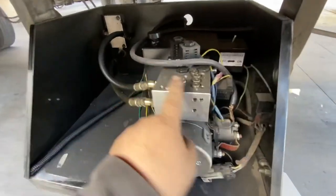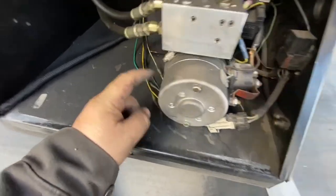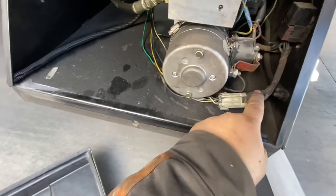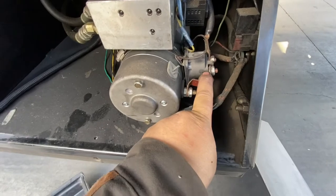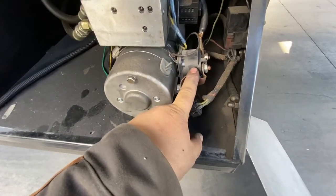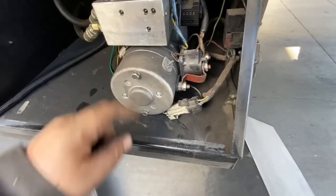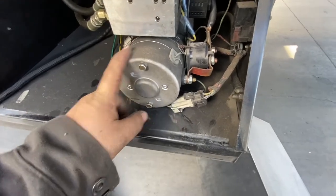The power for the breaker — the wire comes down here — and this is your solenoid, here's your electric motor, and there's your pump. Sometimes you have fuses in here and those can pop. This solenoid — if you hear click, click, click — sometimes these can stick. A lot of times you can smack it with a hammer or a rock and it'll start working again, but you need to replace it. You can get a click, click, click from the motor brushes too — smack that and you can get those to start working again.